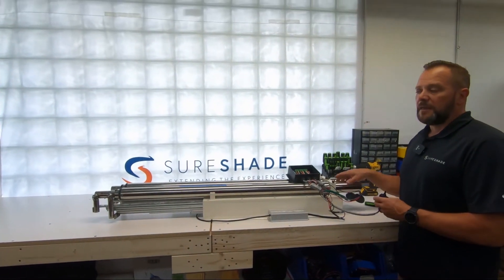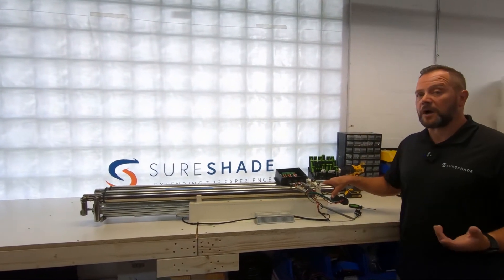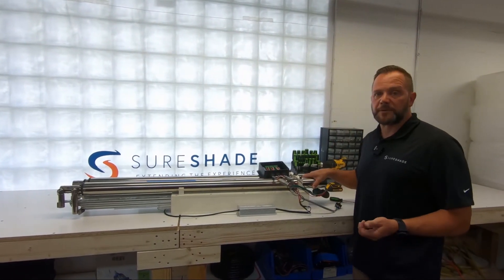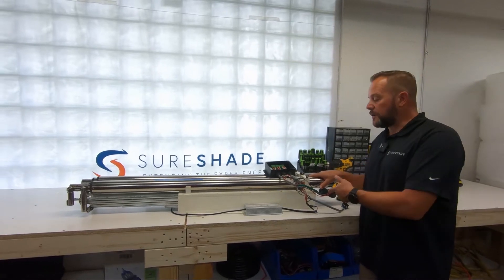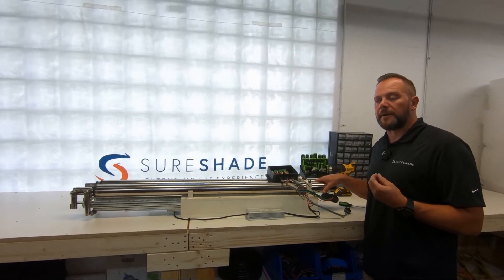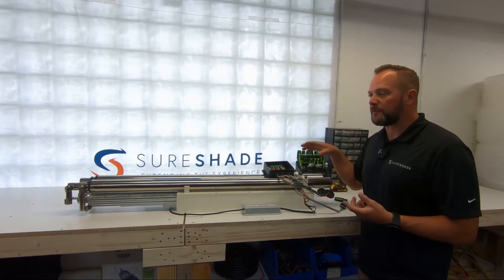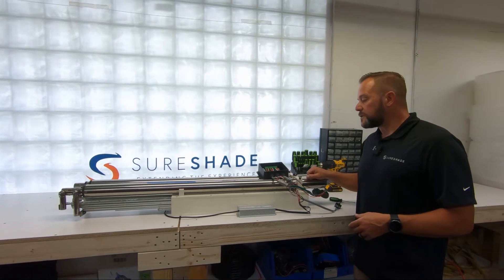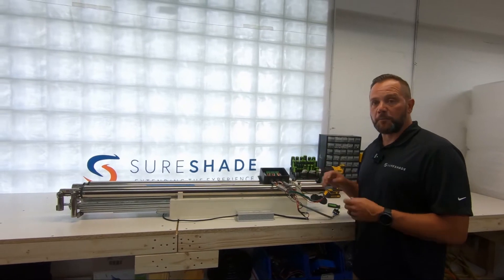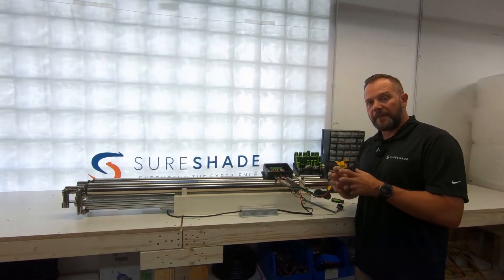On a test bench they were not stuck together. The other thing that could happen — and techs talk about this all the time — is blowing the 15-amp fuse. If you did that it's usually because your actuator is jammed up. You replace the fuse, hit seven to reset, go to hit extend, and all you hear is either a chirp or a very light sound coming from the motor being jammed up. In that case, this controller doesn't send enough power to break those two apart — that's where your bearing assembly and flywheel get jammed together and won't come apart.